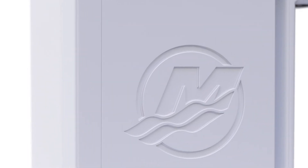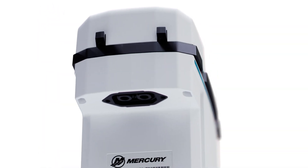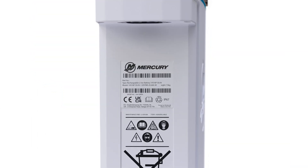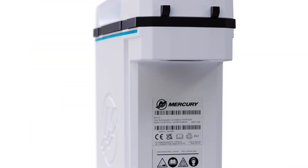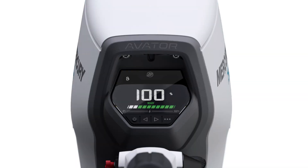If you're operating the outboard and the BMS detects an issue, such as elevated battery temperature, the system takes action to protect your outboard. It will notify you through the display and with an audible horn while reducing available power. If necessary, it can even shut down the battery, stopping power from reaching connected hardware.